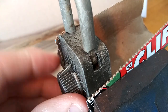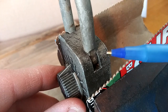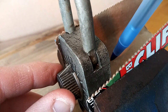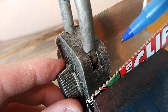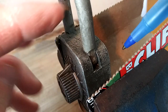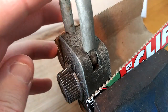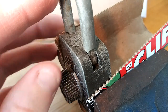One of the other ways I tried to decode this originally was — if the visual gaps are not very tight — you can get a tiny little shim in there to try to act as a little flag to go back and forth as you go. I found that a little hard to do. I also tried a shim thing using another stylus, just lightly touching, so if it moved this way the stylus would get pushed this way, and if it moved that way it would go that way. Those were not so reliable. But thankfully, it seems like a lot of these are decodable like this.